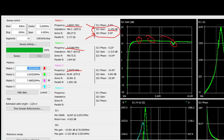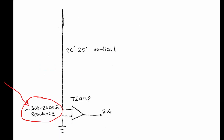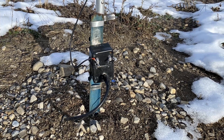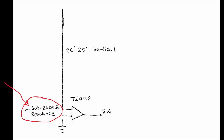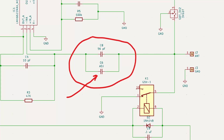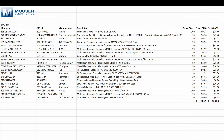The S21 phase does change with frequency. If you use these amps for other antennas, be aware that the amp must see a very high source impedance — somewhere between 1,600 and 2,000 ohms. If you just hook it up to a low-impedance antenna, it's going to produce mostly noise and junk. However, you can experiment with inserting a series capacitor to bring the input impedance up, just like I've done with the BOG amps.